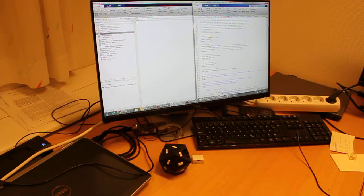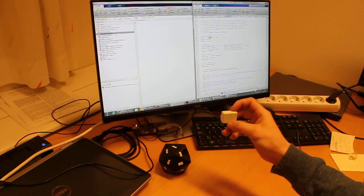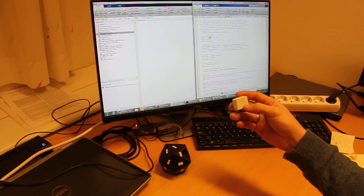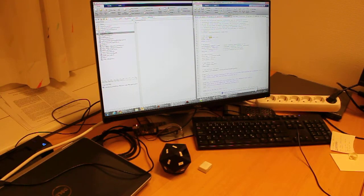If you don't run 64-bit Windows you will also have to compile some MEX files. Before you do the calibration you should let the module warm up to reach a stable temperature — simply turn it on and let it sit for about 10 minutes; that should be sufficient. The module needs to be paired with the computer, and the module model and the COM port will need to be filled in at the top of the main file of the script package.